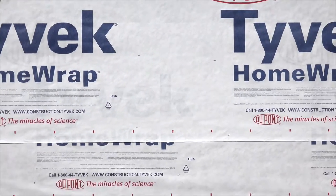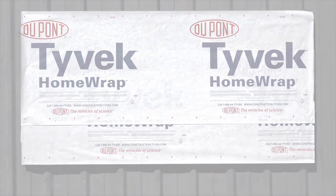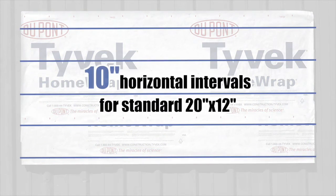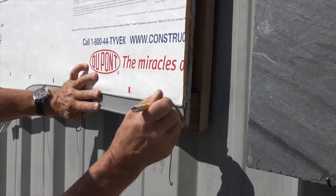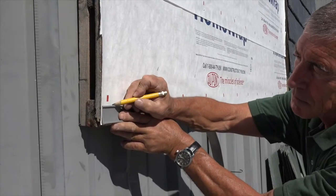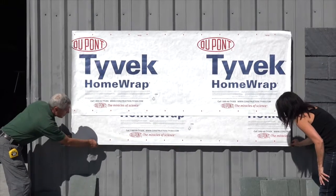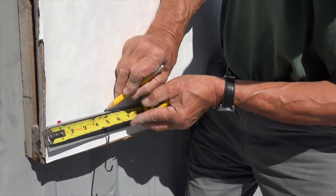Prepare your wall in accordance with your local building codes. Lay out horizontal and vertical chalk lines to ensure accurate placement of the Quickslate cladding strips. Set the provided foundation hook strip at the base of the wall and mark the position of the top of the foundation strip. Mark the position of the first hook of the foundation strip.